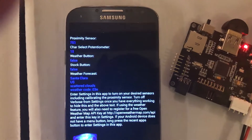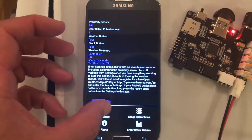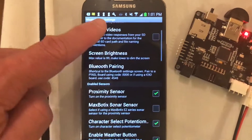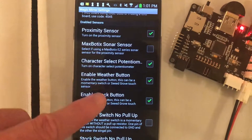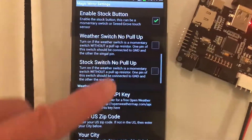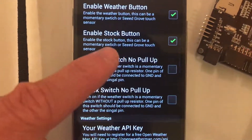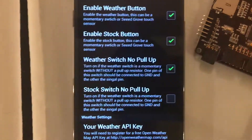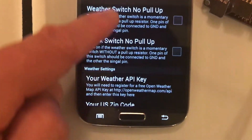Now that you've got all your sensors hooked up, go to the settings. You can do custom videos — that's in the tutorial. This is where you tell it what sensors you have hooked up. I'm using these Grove switches, which have a pull-up resistor already soldered in. But if you're doing your own wiring and didn't want to add the pull-up resistor, you could just click that and hook up any momentary switch without the pull-up. Saves you some time.